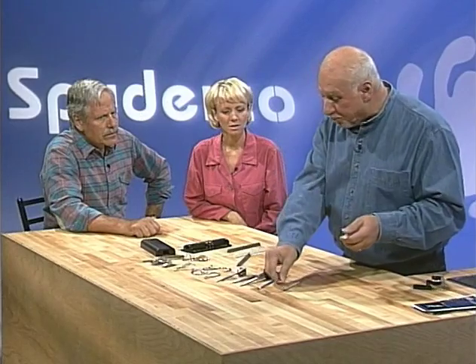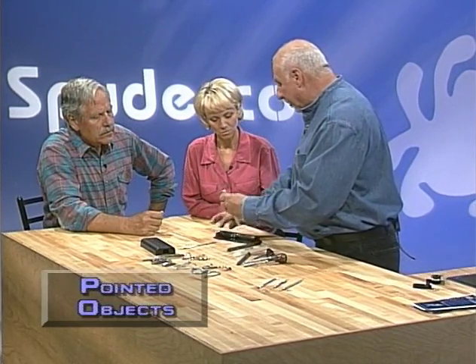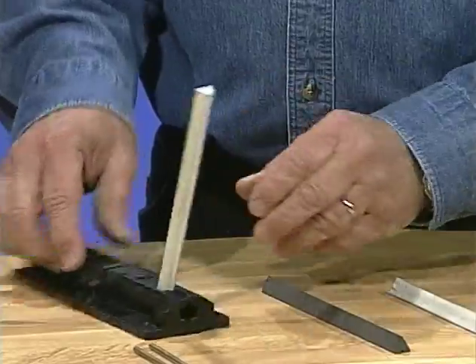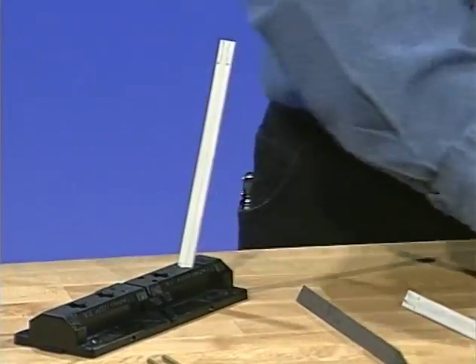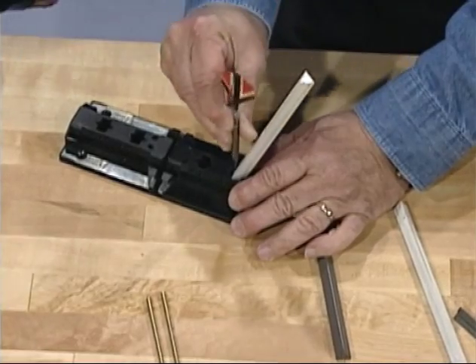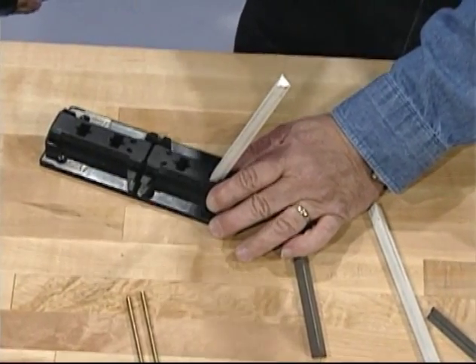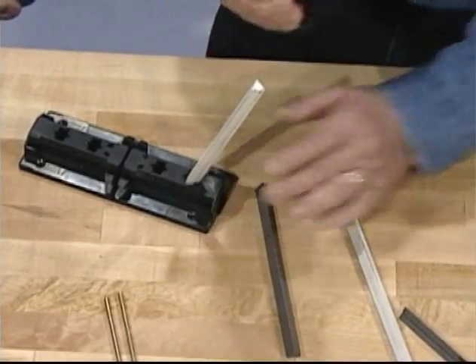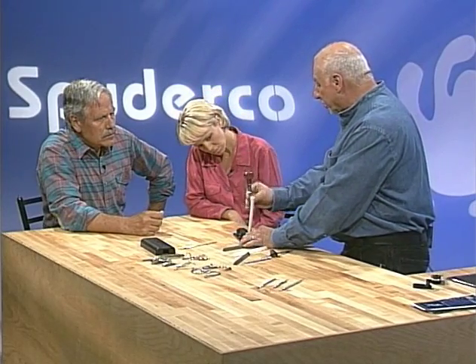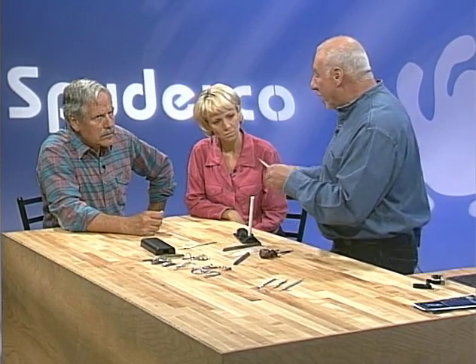For pointed tools like darts, needles, and awls, prefer to use the base for consistency. With a dart you can keep it straight up and down in the hole just like a knife, rotating as you go, to give you a nice concentric point — every time you go back it'll be consistent. The same applies to an awl — make sure to rotate it as you sharpen. For a carbide scribe, the stone is harder than carbide and you can sharpen it using the same method.